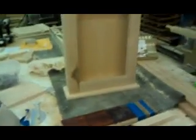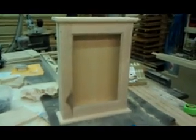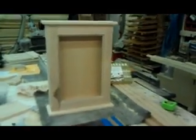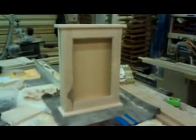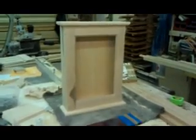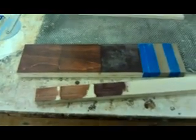I'll be doing a separate video on finishing this cabinet, and like I said, that'll be dedicated to a finishing process with a glaze. In this case, it's going to be a black powder glaze, which I don't want to get too much into on this video, but I can tell you that it's some pretty cool stuff. It is liquid form. When you spray it out, it dries into a powder literally within not even a minute, probably like a half a minute. And then you can take a Scotch-Brite or rag and just rub off what you don't want. So, pretty cool stuff. Alright, that's my tidbit for the day. Thanks for watching.